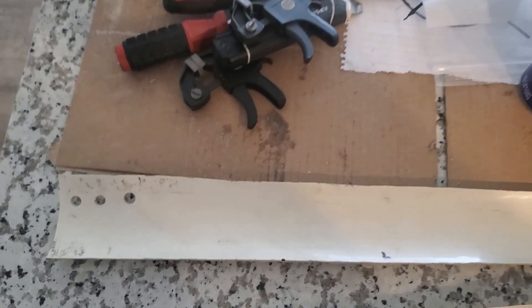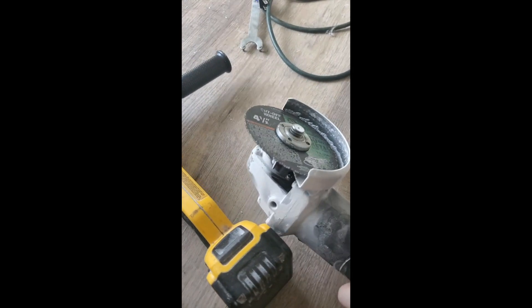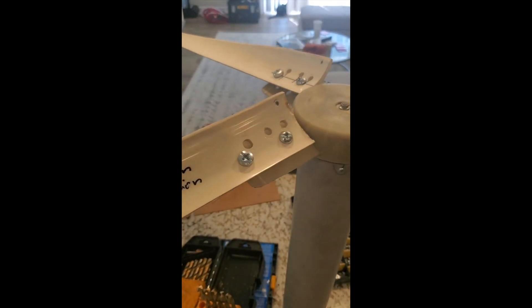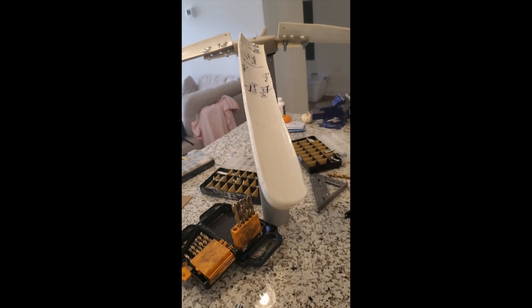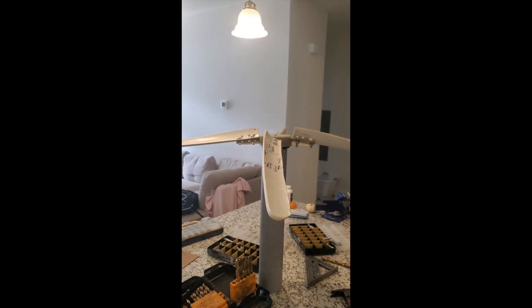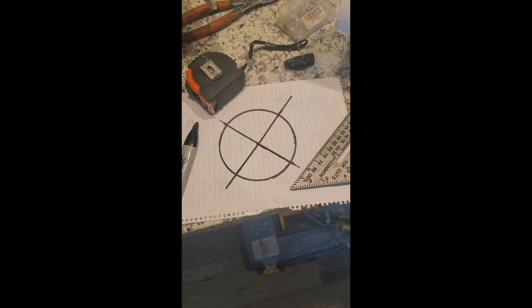The improvements I made in version two were: this time I got the trailing and leading edges the right way around; I made straighter cuts — instead of using a coarse grinding wheel, I used the thin cutting wheel and went for a direct cut. Another tip I found from one of the links is to round the leading edge and sharpen the trailing edge to get it closer to an aerofoil shape, which is ultimately what we're trying to achieve with the quarter of a pipe.